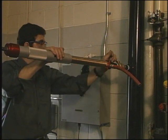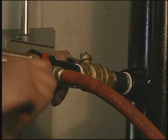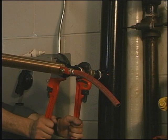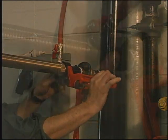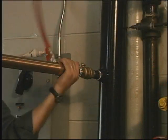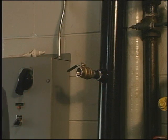Close the valve. Should it be difficult to close the valve, open the bleed valve again and wash away as many remaining chips as possible. Ensure that the ball valve is closed before proceeding. Secure the valve to prevent it from disconnecting as the tool is unscrewed. Be prepared for the tool to suddenly come free, as it may spill out any media it contains. If the drill pipe was dry, be aware that the cutter may be hot. The new service may now be attached to the outlet end of the valve.